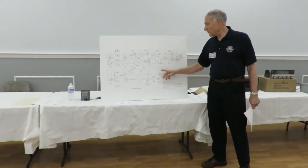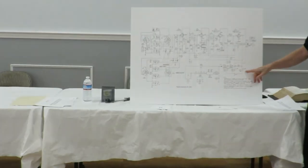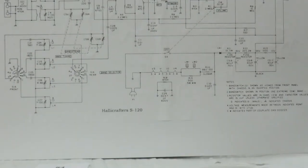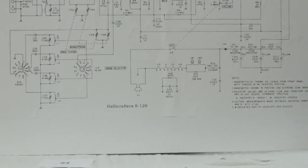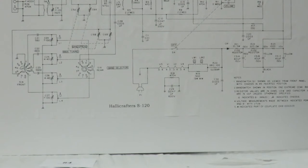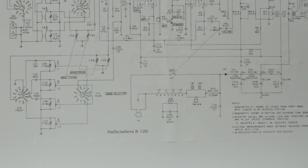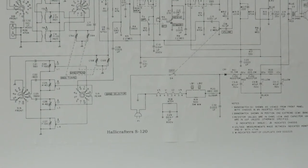So anyway, in this radio, as I said, you have the diode. When these capacitors fail, especially in the five tube radios, it's very easy to just bundle up the three capacitors. I'll cut the can open, take all the stuff out of it, replace them with new capacitors, and use JB Weld to epoxy that together. When it's all done, you cannot tell it's been done. It's just a perfect repair.